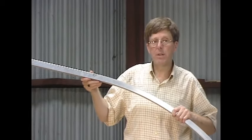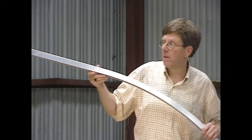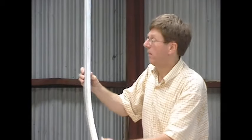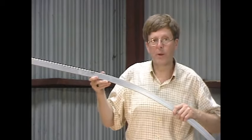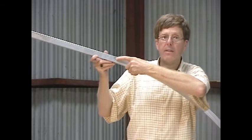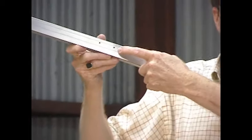It's important that when you assemble your Riga greenhouse and you're going to use your corner curved profiles like this, this only has one channel on one side in it. The other side has no channel. So these are corner profiles. One of your four corner profiles actually has two small holes on the outside, near the top. These are actually to place your door connector in.